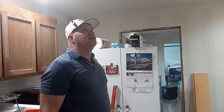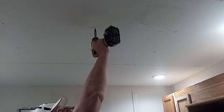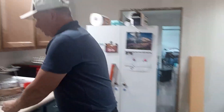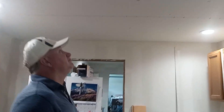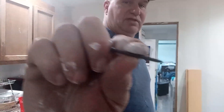A lot of mobile homes and mobile offices have these little buttons that hold the drywall up while you're bouncing down the road. You can take those down. A lot of people worry about it because they're worried they're still going to come down. You can take one down and then put a screw up, which is a drywall screw that looks like that.